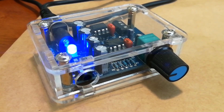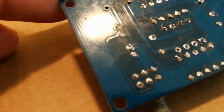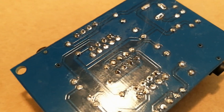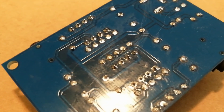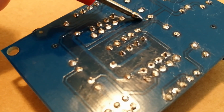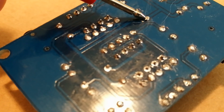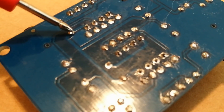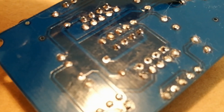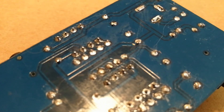It's all done, the power supply is plugged in and it's time to check it out. But after assembly I powered it up and it's not working — the volume is really really low. I got my meter out, traced everything, and it seems that when I cut one of the leads off I nicked the circuit board trace right here. I can see the damage and I'm not getting continuity across that point like I should. So I'll work out a fix for that and try it out.